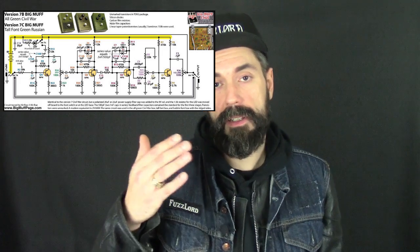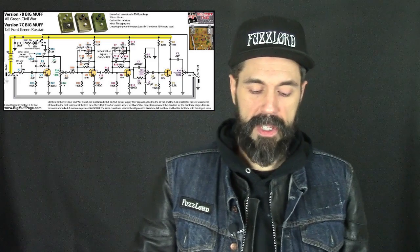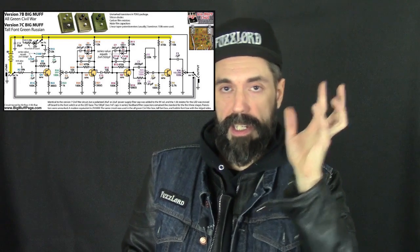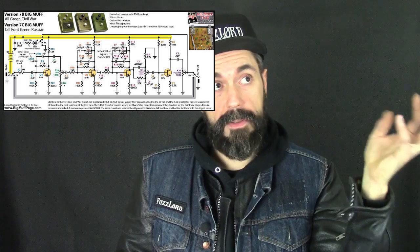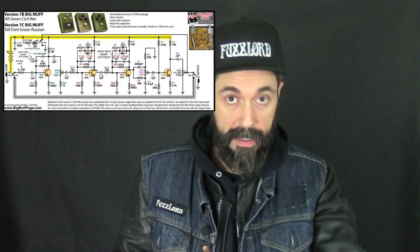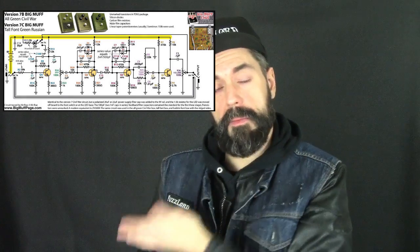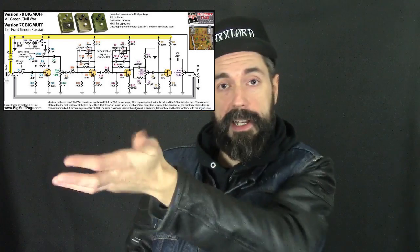Now in between the 3rd and the 4th transistor, like blocks 3 and 4 is how I think of it, we have our tone control. It's really cool. You turn it one way and we utilize one filter, which allows lows to pass. It takes the highs and it bleeds them to the ground. Then we roll the tone knob the other way, and we connect our signal to the opposite kind of filter where it takes our lows and dumps them to the ground, lets our highs through.